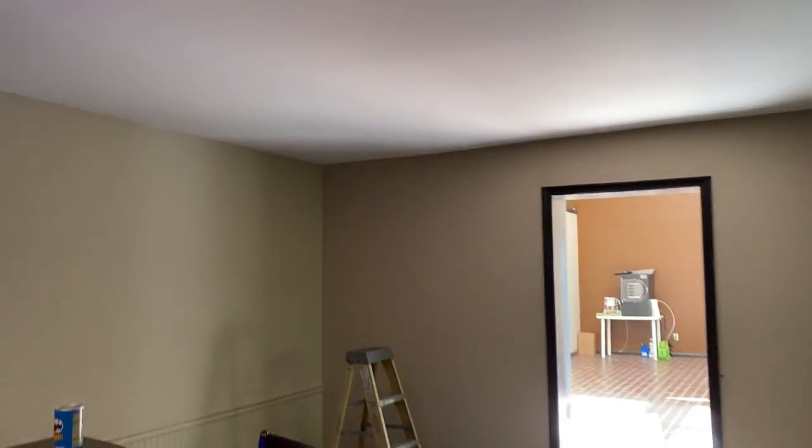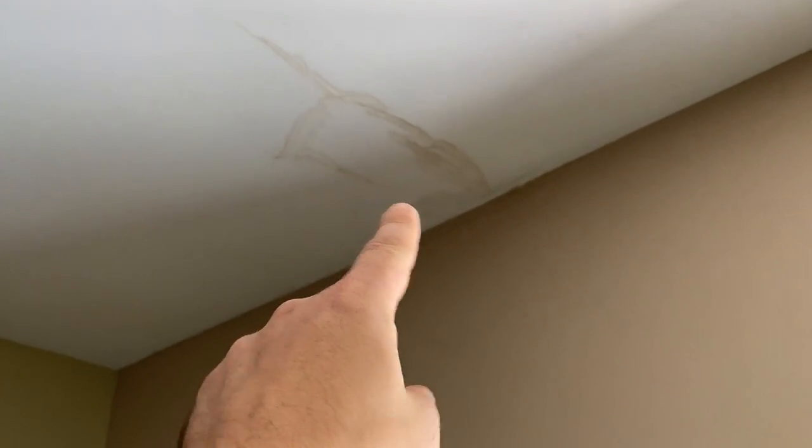The solution that I have found, I believe, is to cut this drywall. We actually had a leak in the kitchen sink upstairs anyway, so I have to fix this drywall anyway. So we're gonna cut this out, see where that drain pipe runs, and I'm gonna try to run it out this wall into a crawl space that is, as far as my measurements are taking me, on the other side of this, above the ceiling here. I can tie it into another sewer line or drain line that goes out and runs around the house and connects to the main line on the upper side of it. So that will help us to bypass all of the underground sewer pipe.